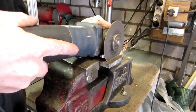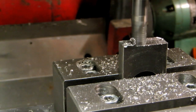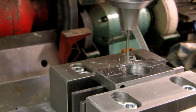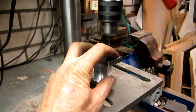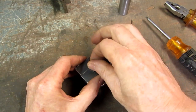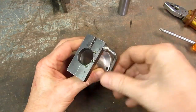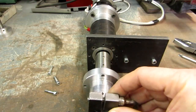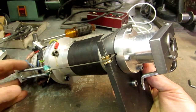Now the plate needs to be cut to the correct size, then some milling to make the sides accurate and clean. Here I am drilling and tapping the hole for the tightening handle, and finally drilling the holes that will fix the plate to the front of the aluminium sleeve. Now we can assemble the pieces and check the gripping action, which works quite well. We can now mount it to the motor and gearbox assembly. You can see that the preload rope fits well in the slot of the sleeve.